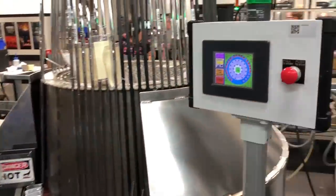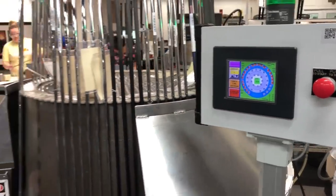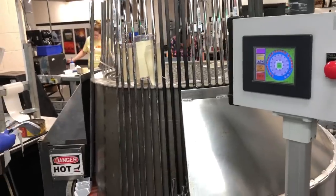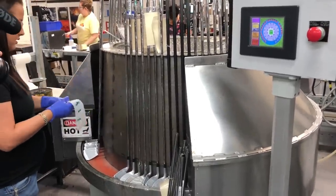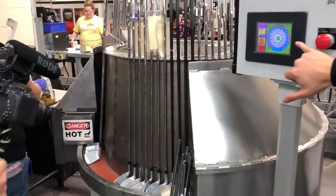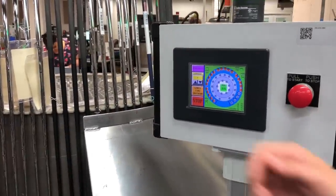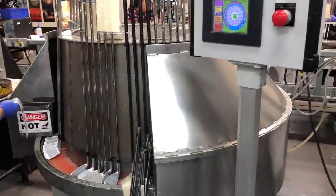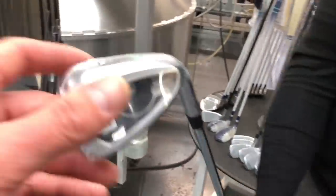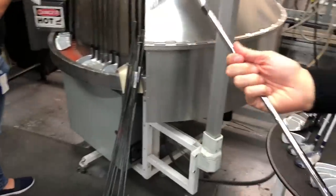You can see the different heater systems all the way around — it works in a clockwise rotation. When the golf clubs come through, the glue is completely set, so you could technically go out and start playing golf with it straight away. We have four cooling fans on the end so that the product is not too hot to touch. Depending on the product, it takes around 12 to 15 minutes to cure. You can feel that it's not particularly hot to touch, so you can continue working with the product going forward.